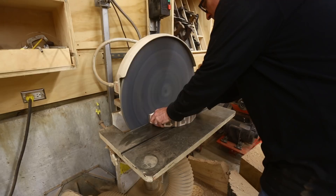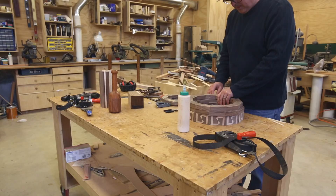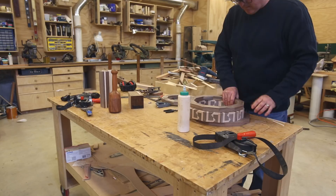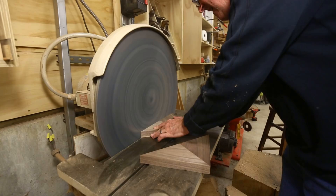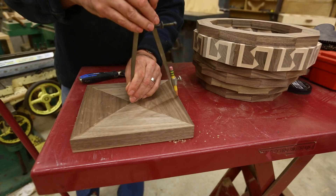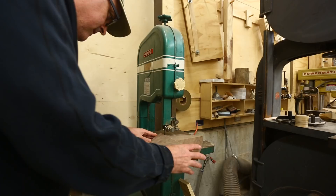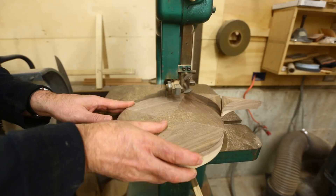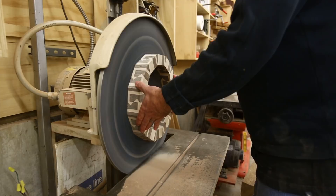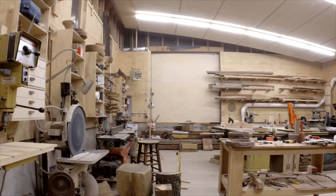I had to take the decorative ring and sand the two halves to make them go together perfectly, then glue them a second time into a complete ring. Then I started thinking about how the rings were going to go together. I wanted to make a bottom for the bowl, and I found it's a little easier to do this with four big pieces so the four corners come together perfectly in the center. I drew a circle on the bottom piece to cut off the extra and cut it into a circle, which means less material to remove on the lathe. I sanded each ring on its face so they would go together without gaps.